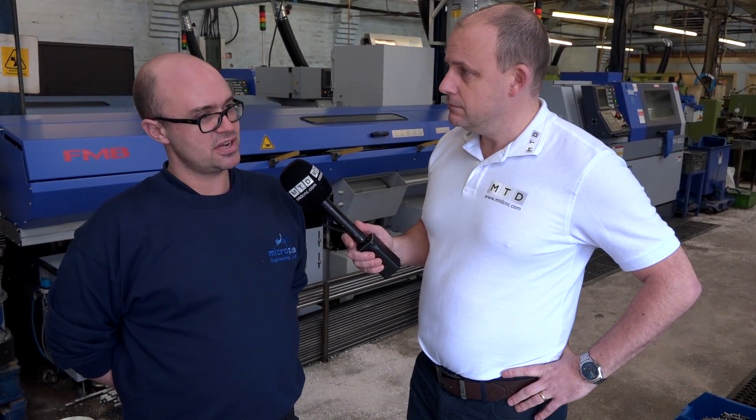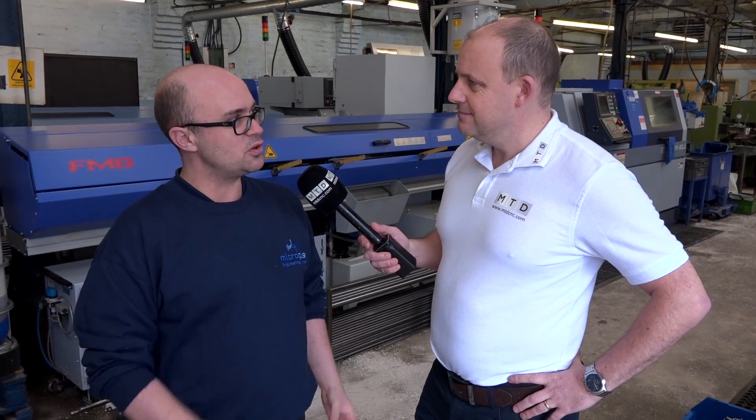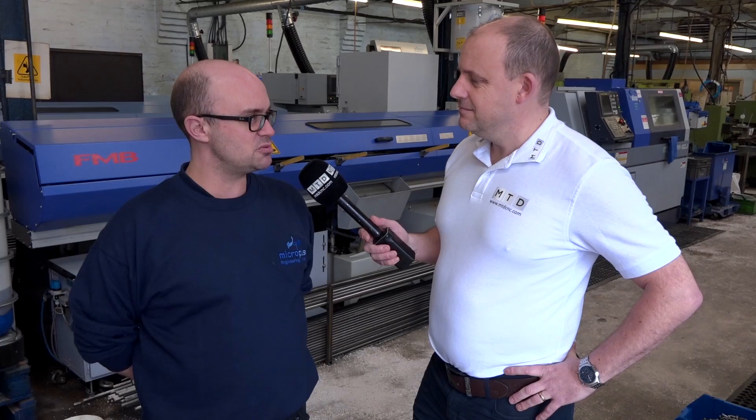How much of a difference has it made — a bit of a eureka moment for the company? Yes, it's a no-brainer to be honest. If you've got a Star machine, you should have this software installed as soon as possible just to keep yourselves up and running. Have you experimented on non-metallic products like plastics or nylons? Yes, there's a job we do in nylon for the road industry. Before HFT, it was made on my dad's capstan Nemi-Mec. We tried it on the Star but got so much swarf building up we couldn't keep it running. But with HFT and a bit of help from Alic at Star, we got the programme through the machine and parts just come off complete, into the washer, out the door. You can use it on anything apart from mild steel and brass.